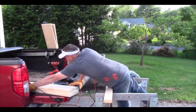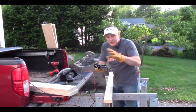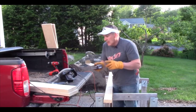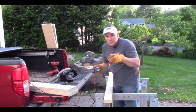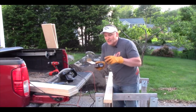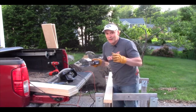By the way, you need to get some screws — you want galvanized screws; they have coated screws too, but galvanized is the thing to ask for. I'm using two-and-a-half-inch screws. You're going to need a total of eight screws per corner, so you're going to need 32 screws to build a box.